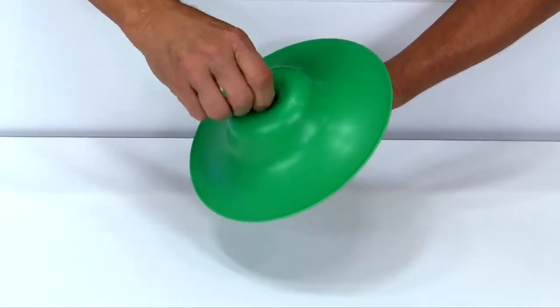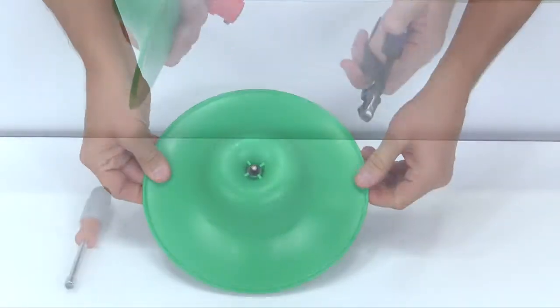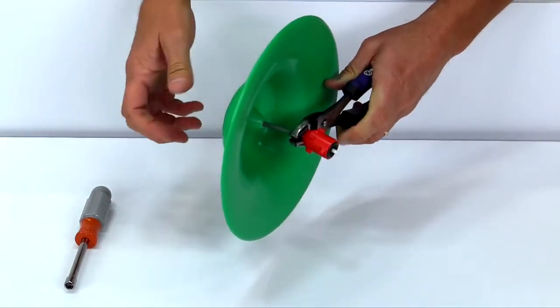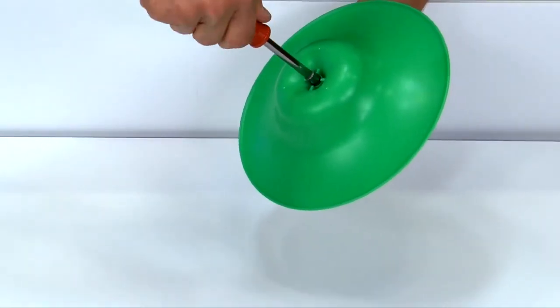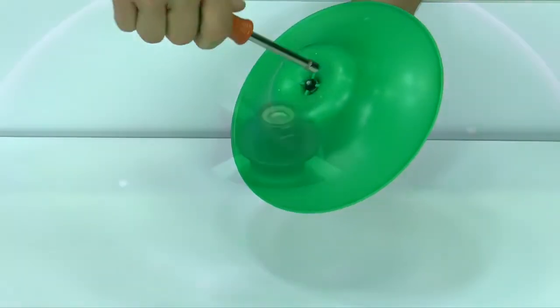Now there are two ways you can properly tighten the nut. Either way you choose, you must avoid over-tightening. First, you can use the nut driver to tighten the nut. Hold the stem of the drinker with pliers and tighten with the driver. Tighten the nut so the end of the activator pin is even with or slightly protruding from the nut.